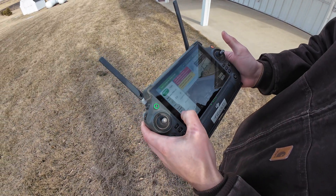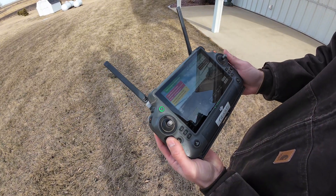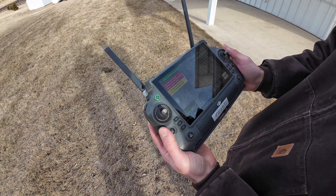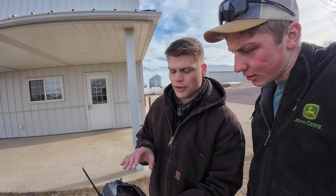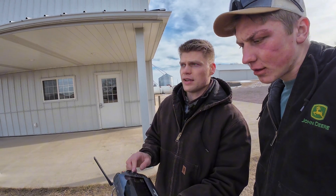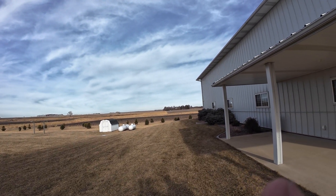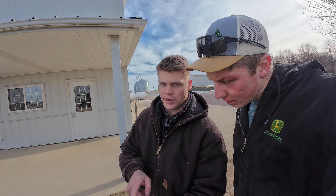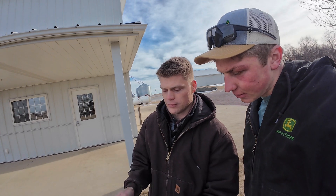You can scroll the camera when it's going — look up, look down, straight ahead. I just turned it up to full speed. Right now it's fully autonomous. If it sensed an obstacle it would stop, but if I saw something and wasn't comfortable, I can just pull back on the stick and it stops. To resume, just hit resume — it went backwards a little bit so it goes back to where the spray turned off, not where the drone stopped.